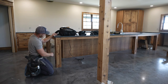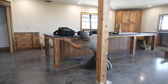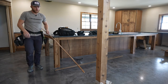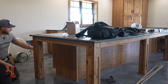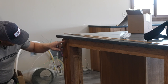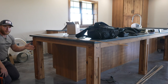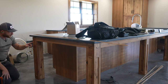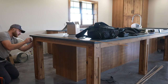I'm going to cover that gap up — instead of using caulk, I've got some extra scribe trim and I'm just going to place that. Sixteen and five-eighths. The other issue is this concrete came down about a quarter inch this way. The posts were 34 and a half inches and I needed to bring them up, but didn't want to trim around the base, so the decision was made to put the gap up here — another reason we're doing this scribe trim, because it'll cover that up too.